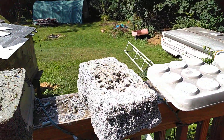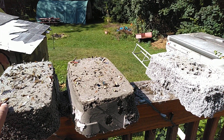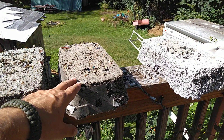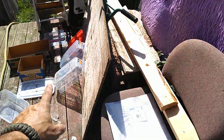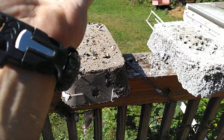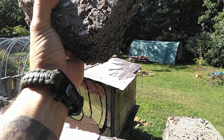And this is my failure. These were way too much foam. I used half the amount of Portland cement to a gallon of water and just kept adding foam until I got five gallons. When I dumped the mixture into those containers, the solution actually floated to the top and some of the water separated out. This one was still draining like 10 minutes ago — you can see how wet it is down there.